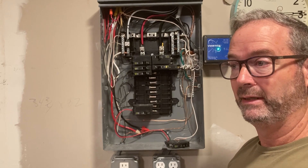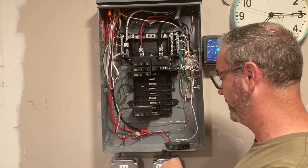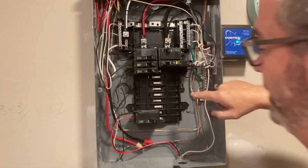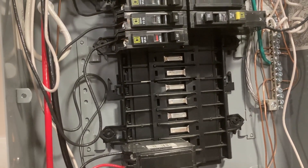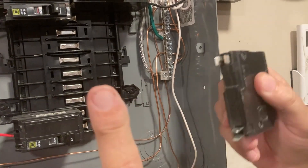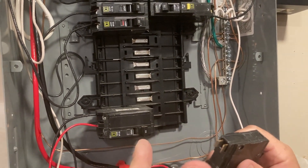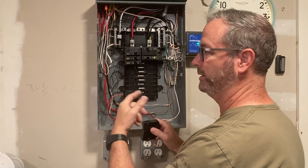At that point, get an electrician to come out, pull the breaker off carefully — carefully is a big deal. Now, this is a panel I would recommend. If you get in closer — and this is hot right now — look at these flat bars; those are the buses. They're tin-plated copper and they're going to last a long time. The metal in those is very, very hard. This is meant to ride over and these two legs have to spread over and close on that bus — it's a very strong, very tight connection, and that's what we're looking for. The other panel I like that's similar is the Eaton CH with the tan handles; the busing looks very similar. And the Siemens, if you get it with the copper or tin-plated copper brass busing — same thing.